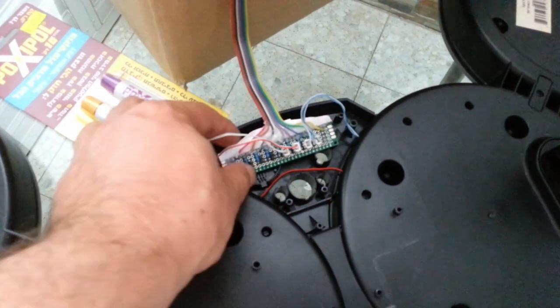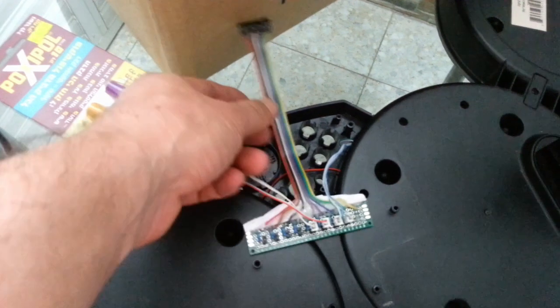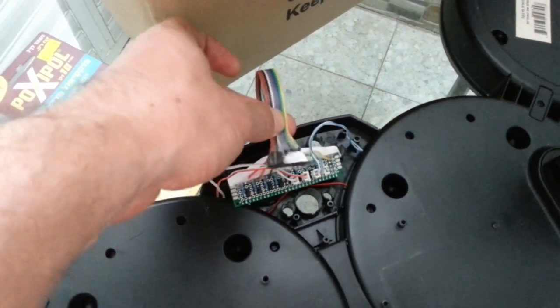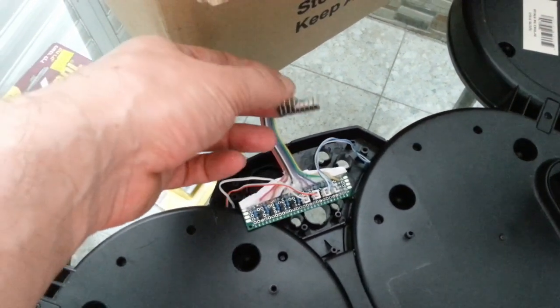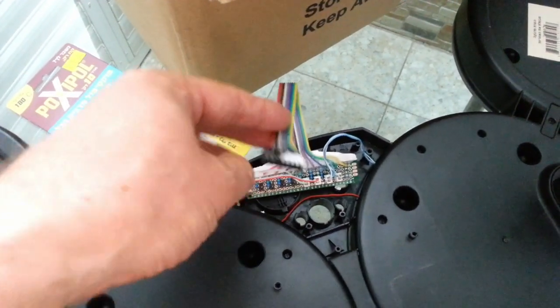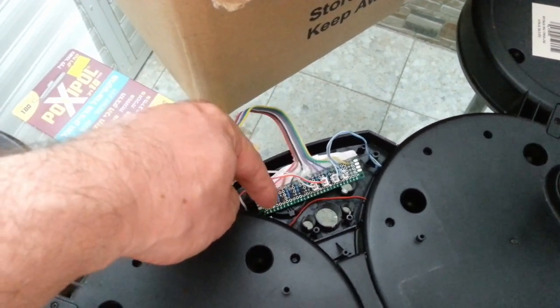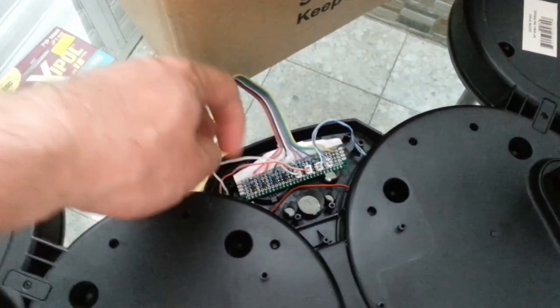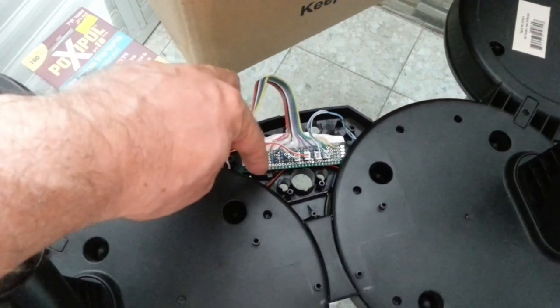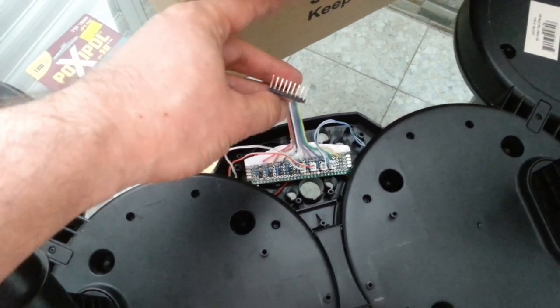One more thing about the connector: the reason I chose to do it this way with a strip is that I don't know what the final format of what's going to read those sensors will be, and I wanted something firm I can test with. There's a one megaohm resistor in between the two sides of the piezo to protect the input pins.